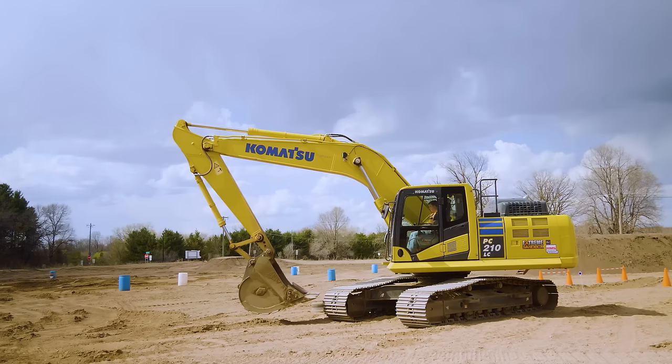Again, this is not necessarily going to be the strategy. To me, there are phases of learning any piece of equipment, so don't think that the first way you learn it the first day is how you're going to do it all the time. But right here, I like to have my teeth straight down before I go into my first scoop. When you get better at this, you're going to want those teeth at a 45, and you're going to take layers off. If there's any kind of utility underground, you have the potential to hit that, so you want to be able to scrape small layers off.